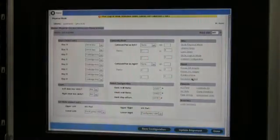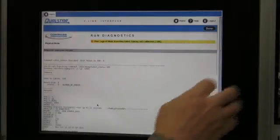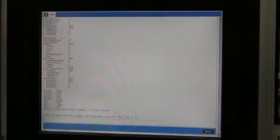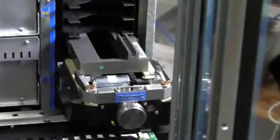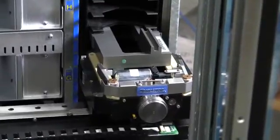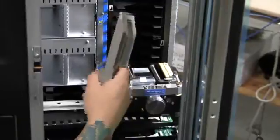Under the robots section, we need to do a get robot status. Once you select that option, we're going to get a diagnostic output. The information we're concerned about is scrolled down all the way at the bottom and we need to take note of the T position. We need to write this number down. Once we have written down the T position number from the right side, we need to manually move the X-beam down and remove the gripper alignment tool from the right side.